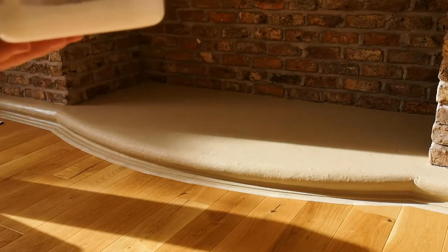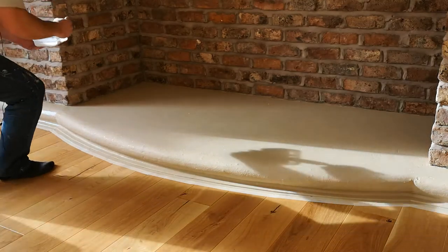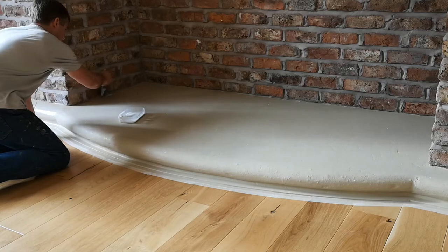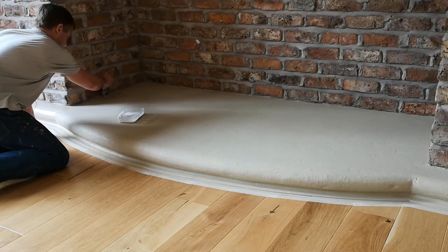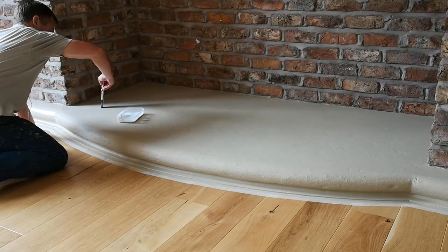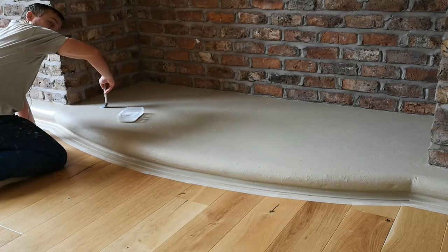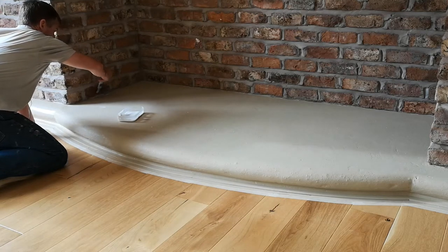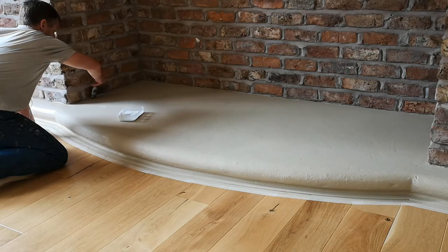same thickness. So, best thing to do when you're applying the brush, go around all the edges first, carefully go around the border, so you can go nice and slowly up to the brickwork. You want to just place the brush down, fold it slightly away from the brickwork, maybe 45 degrees, and then drag. So apply it, pull it down at 45 degrees, and then drag.